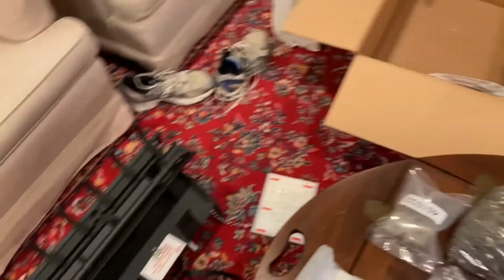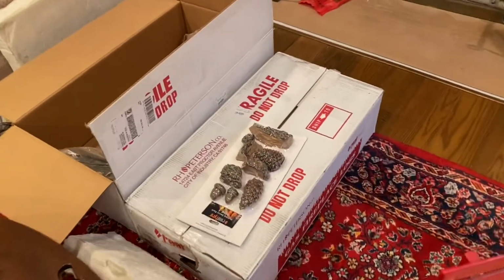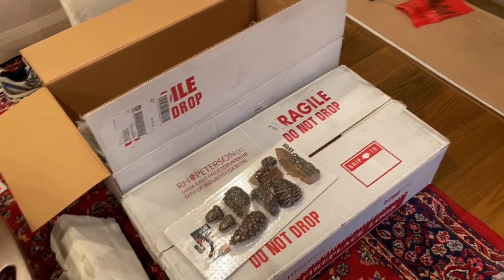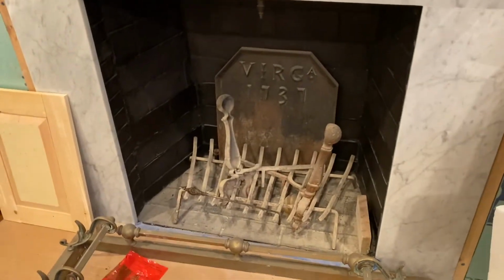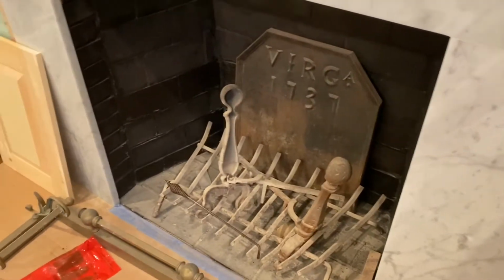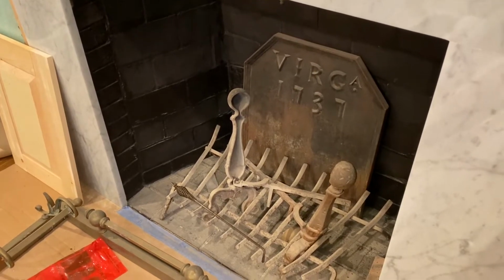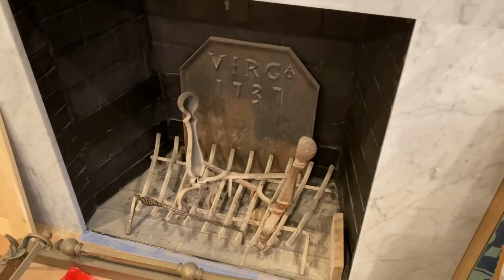So it's a really cool set. They call it real fire, and it has a very real appearing flame. It's not a blue flame, it's kind of a yellow flame. It's actually meant to be burned in a fireplace with the damper open, so you got full ventilation. Because the combustion that provides for that nice yellow flame would get a lot of contaminants and stuff into the atmosphere in the home if you didn't have it properly vented. So you got to have a properly vented working fireplace to install this sort of log set.